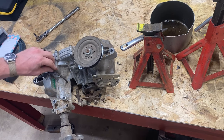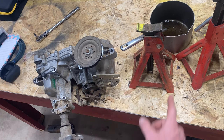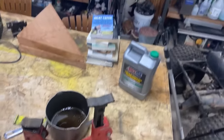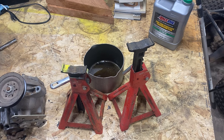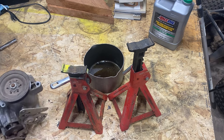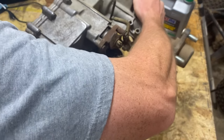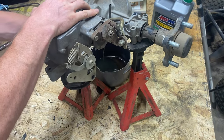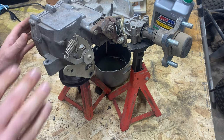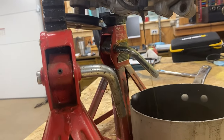So now you're probably wondering, well, you take it out — what's going to happen next? That's where I've set up my fancy jack stands and my wife's stew pot. I am going to flip this thing upside down without spilling any hydrostatic gear transmission oil. And if anybody who knows me knows, this is not possible because I make a mess with everything I touch. We're inverted, hitting the pot — things are looking good. Look at that thick, gnarly stuff. That there is straight 30 weight oil, about 10 years old, coming out of the hydrostatic gear transmission.